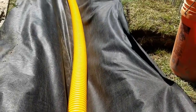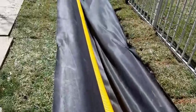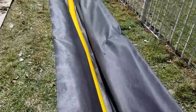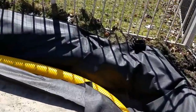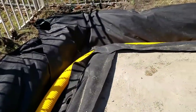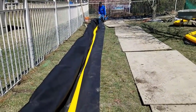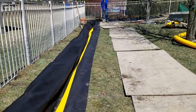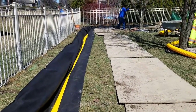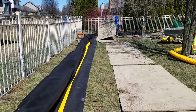You want the pipe on the bottom, but you can't do that unless you use pipe with five or eight slots. We use the five-slot for applications where people are going to be driving on it because it makes it stronger. This is a backyard — normal lawnmower activity — and even some vehicle traffic is not a problem; it's only when regular vehicle traffic is expected that I'll go to the five-slot. We also use the five-slot behind all our retaining walls. Here in Michigan, if we don't drain these French drains out in the wintertime, the system won't perform when you need it because it will have so much ice at the bottom.